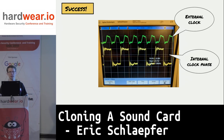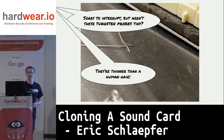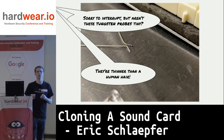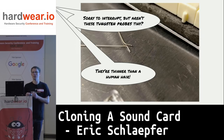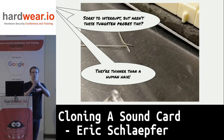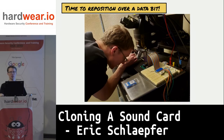I was able to blow a hole and contact it with a tungsten probe, and I got a clock signal. The ringing on the signal is just because of the very long wires in the test fixture. The tungsten probes, by the way, are finer than human hair — they go down to a submicron point. The tungsten is welded onto a soft wire you can bend into different shapes. The art of microprobing is bending it to just the right angle — too steep and you can't see the probe tip under the microscope; too shallow and you're on the edge instead of the tip.